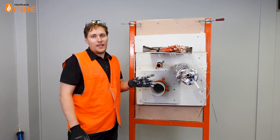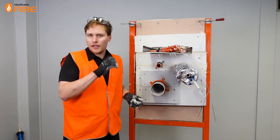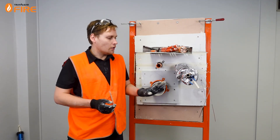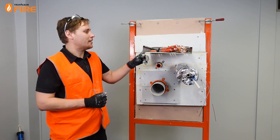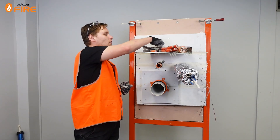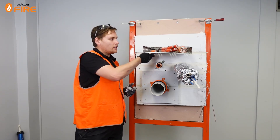These Firebox Minis are fantastic for mixed services, as well as things like pair coil, insulated pipes, copper pipes, steel pipes, PVC, plastics and conduits — you can run them all through this one box. Now the last thing we have left to do is to seal the cable tray. For that we're just going to use our Fireflex sealants to fill all the gaps and apply a 50 by 50mm fillet all the way around the cable tray, and then we're going to apply our T-wrap.